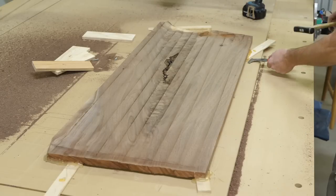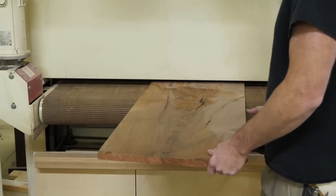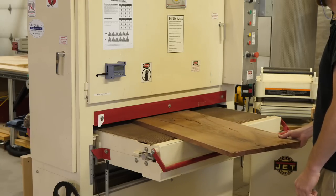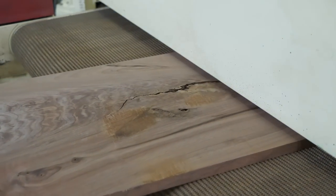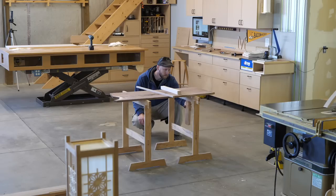This tool will become a central part of my shop. The dark lines are burns — the router bit I'm using needs the cutters changed big time. After getting the first side flat, I flip it over and send it through the wide belt sander a few times to clean up the bottom. I prefer the sander versus the CNC because it's easier to take off just a tiny bit of material, which is important here because the board ended up a little thinner than I was hoping — just a tick over three-quarters of an inch.